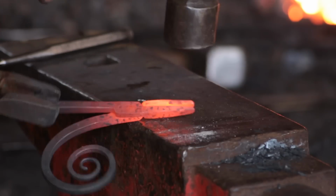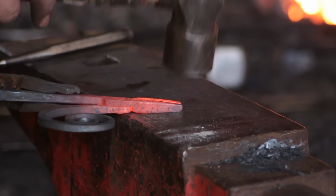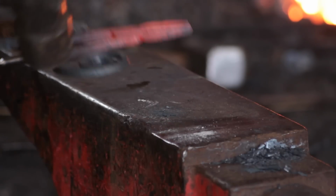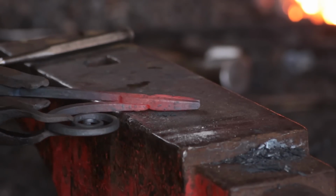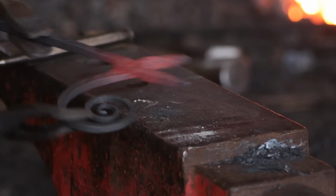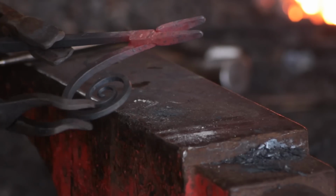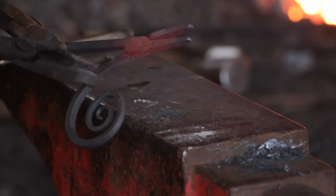At the same time I will slightly adjust the nibs just to make sure that they contact properly and that they're nice and aligned, and finish off wearing that hinge plate in. There we go, spot on. So the jaw has to drop shut the moment you let go of the monkey tail.